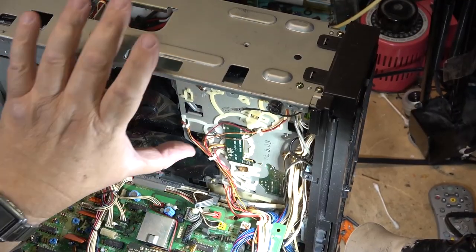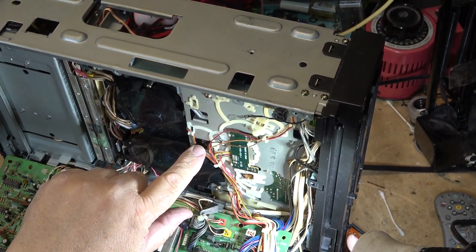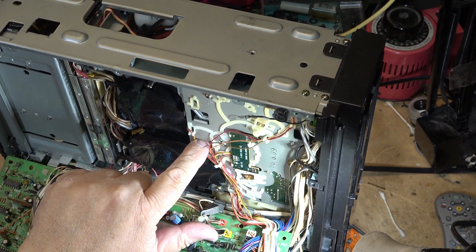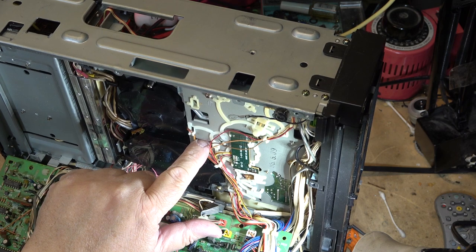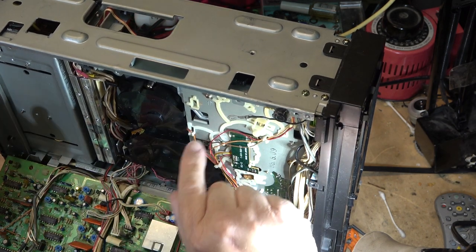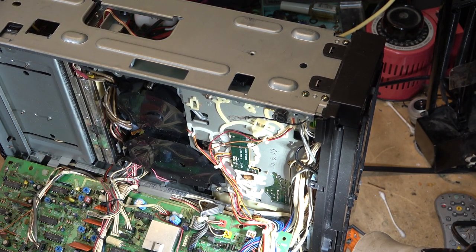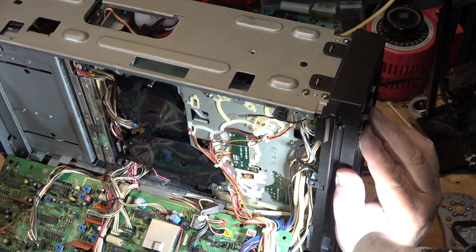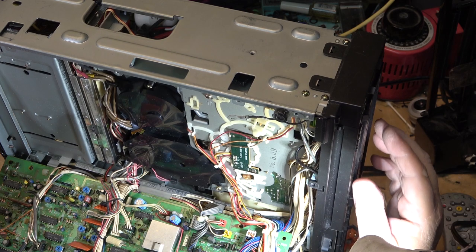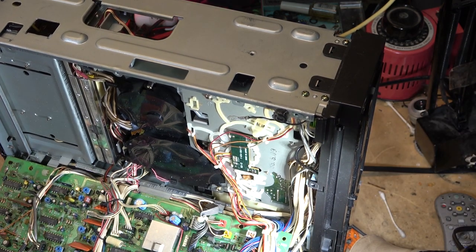Okay, what we have here is a bad solenoid. Probably a fuse is blown in the solenoid here. Watch when I hit rewind, the solenoid that releases the brakes is not working. Okay, so I got to pull this thing apart again and check. I bet you there's a fuse internal on that that's gone open, a thermal cutout type fuse. This is not working. It's not moving.